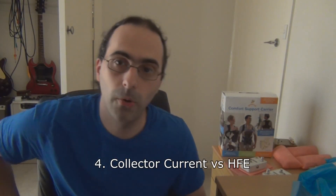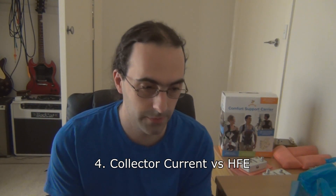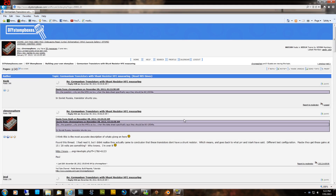The other thing is the reported HFE. On the internet you'll come across germanium transistors advertised with the perfect HFE - like 80 to 150 HFE, a box of 100 for 20 bucks - and it seems too good to be true. You might see threads where people bought a box of 100, measured them all, and they're all 50 to 60 HFE even though the data sheet says 80 to 150. In my case, I bought a box of GT308Vs and found they were all between 50 and about 70 HFE instead of the stated 80 to 150.